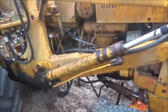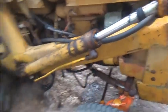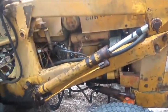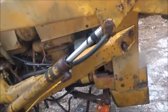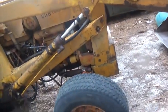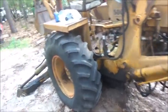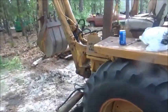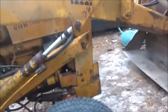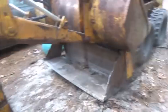We're going to change the pump out and see if we get steering. If we get steering, at least I can put it where I need to split this thing, get the torque converter leak fixed, get the outrigger repacked, put some air in the tires, and get this thing usable. I've got some stumps I need to dig and a tree to take out. I've already dug one stump with it so I know the hydraulics are strong - no problems there. It's been sitting up for over a week now.